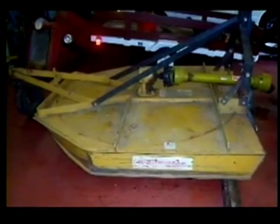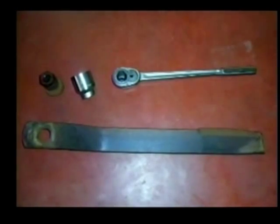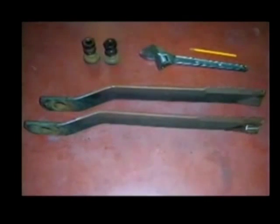This is a King Cutter 6-foot Bush Hog. I had to take my torch and enlarge these holes so I could get a socket on the nut to take the blades off. These blades are fairly heavy — I would guess they weigh 10 or 12 pounds apiece. They needed to be sharpened. You can see the big bolt in the upper left, and a pencil shows you the size of these blades in comparison.